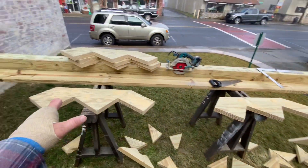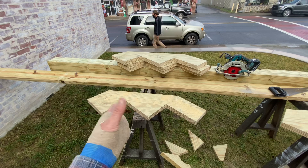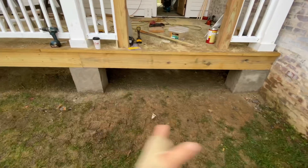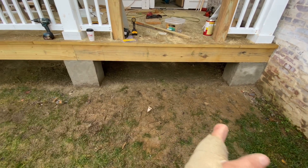That's where they're going. What I'm going to do here is cut a bottom riser and a little hanger board. I'm going to assemble all these into one unit, just like we do on bigger sets of steps, then hang it on the side of the house. I'm going to screw it on there and suspend it over the dirt. Then I'll dig a trench for the concrete, hang it over the trench, and pour the concrete under it as it sits there.